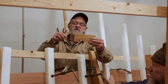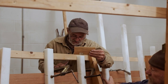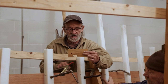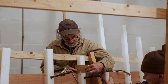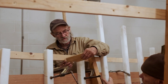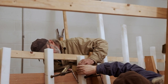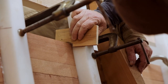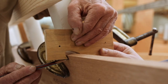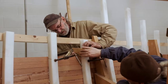One method uses a little gauge we made — it's got a small aperture cut out to reach over the top of the plank. We lay this part against the line, slide it up against the plank on the outside, and make a mark right underneath it on the outside of the plank. Ken lines it up with the mark and slides it over, and I make a mark on the shear plank with my pencil right outside there. Just like that.